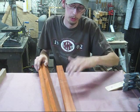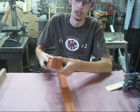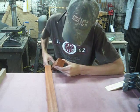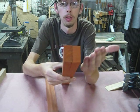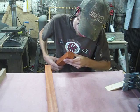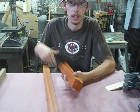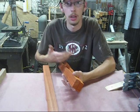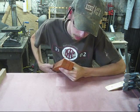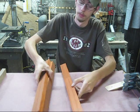For gluing up these boards, it's pretty simple — all the faces are going to have glue applied to them. You could get away with gluing one face, placing a board on top, and setting your clamps. Keep in mind you're not exposing the side grain when the piece is done; this is an end-grain cutting board. If you look at the end grain, you can see the grain pattern deflecting back and forth. You can match them or alternate them for contrast — either way it'll be a beautiful board.